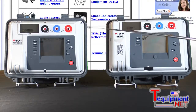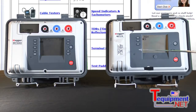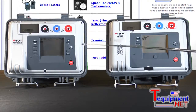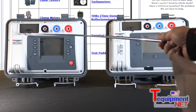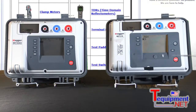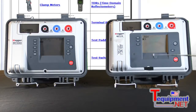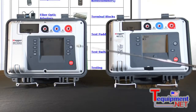There are three models actually in this line. This is just a straight 5 kV insulation tester — you just set whatever voltage you want. This is not an RS-232 port for downloading. The other two models: we have a 5 kV that has RS-232 and also USB downloading capability. The other difference between this model — the 5 kV and the 10 kV — is the insulation resistance. They go up to 15 tera-ohms, whereas the 10 kV goes to 35 tera-ohms.